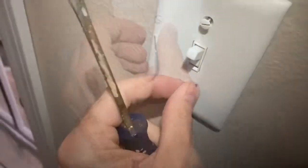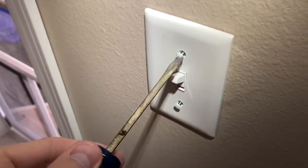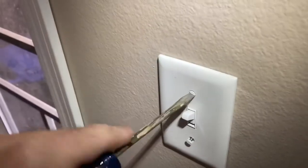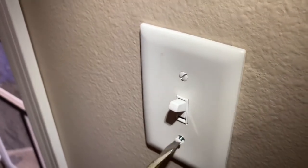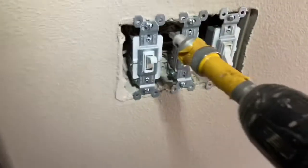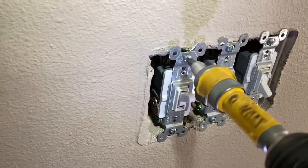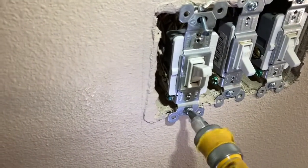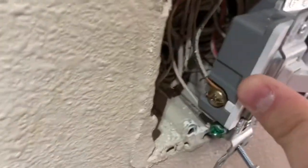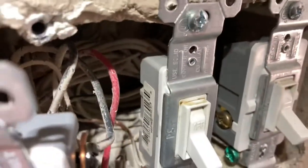Go ahead and put the wall plate back on. A little note: do not over-tighten these — I've cracked plenty of wall plates before I learned my lesson. Never do this with a drill; always hand-tighten with a screwdriver, taking really good care on those final couple of turns. Now we're going to rinse and repeat — go back to the second light switch, the one on the left. We'll take the switch out and do a visual inspection, making sure nothing is going wrong and there are no loose wires.